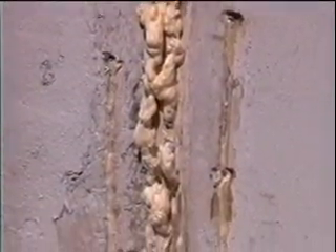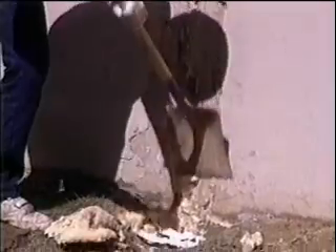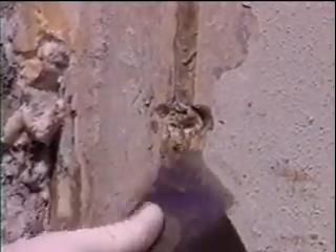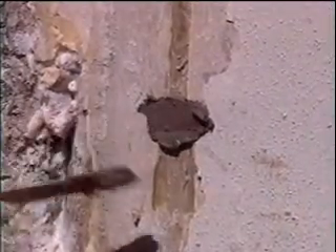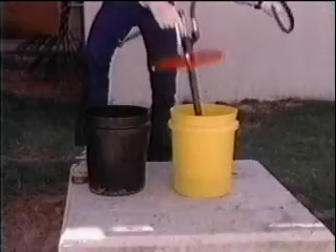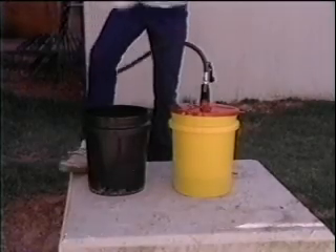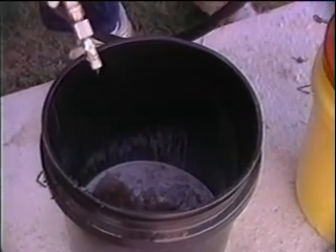Our crack injection project is almost finished. The grout is fully cured and we can see good coverage all along the joint. We are now ready for cleanup. Scrape off excess grout — a flat shovel, ice scraper, or putty knife works well for this. The injection ports will still have a little grout around them; scrape this out with a screwdriver or scraper. If any grease zerks are protruding, break them off or bend them in. Then, if desired, patch the ports with a little cementitious grout. Our crack repair is now complete. Remember to flush the pump — the remaining grout should be flushed out and replaced with pump flush. Keep pump flush in the pump until the next time it's used. With proper cleanup, your pump will last for many crack repair projects.